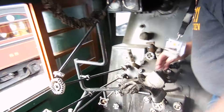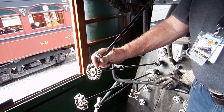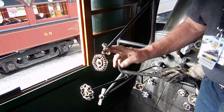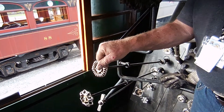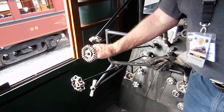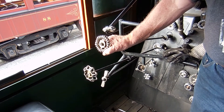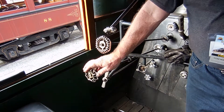Over here you've got the fireman's controls. This handle here is called the feed water pump — that's the second way to put water in the boiler. We usually only use this when you're going down the railroad because it uses exhaust steam when the engine's working. This is the stoker blast — the steam jets push the coal out all over the firebox, and this actually runs that engine.